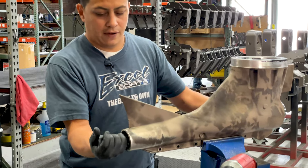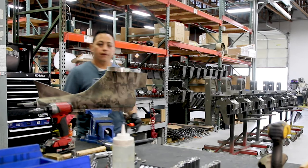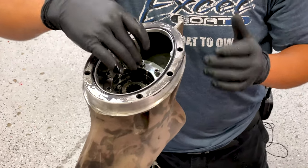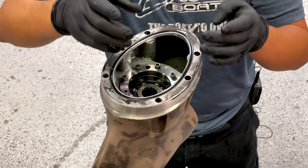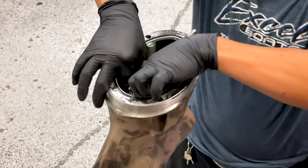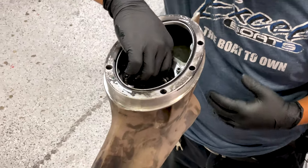Now I'm gonna show you how the input gear works. We have what we call the input carrier — that is just two big bearings with two spacers and the gear that transfers the power from the transmission into the prop shaft. It is pretty sophisticated the way it comes in and out. It has adjustment — you can see how it spins — we adjust the bearing load and the gear lash so it doesn't make noise and wears evenly.